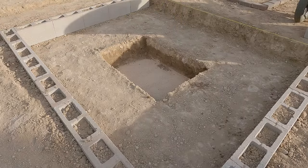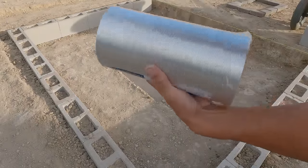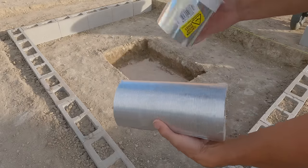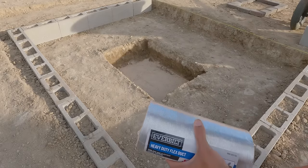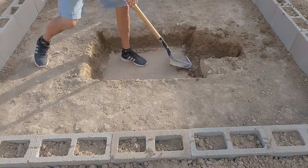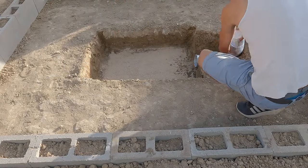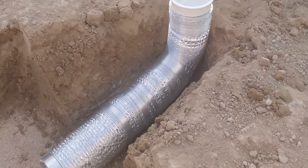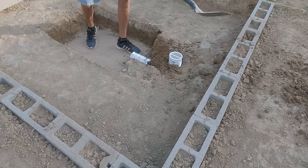As I started pouring the sand I realized I forgot one very important step. Since the pit is below ground level, there needs to be a source of oxygen to feed the fire. That's why I got this dryer tube extension and a cover for it — this will go to the bottom of the fire pit and up to ground level, therefore allowing fresh oxygen to get to the bottom of the fire pit. I then backfilled a little.